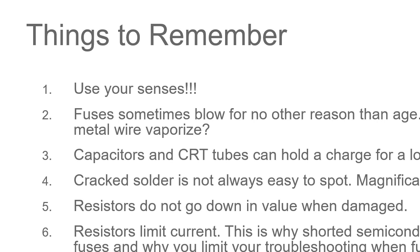Now, GO7, that's a little reminder. GO7 arcade game monitors have two fuses in them. One fuse, if it blows, is after the big mains filter cap, which means the mains filter cap is holding a big charge. That thing will melt a screwdriver tip, and it will scare the crap out of you. So yeah, be careful of capacitors, especially the big ones in monitors. So if you're unsure, use your voltmeter and check to see if it still has a charge on it.